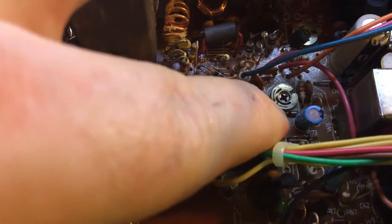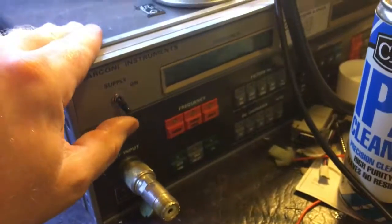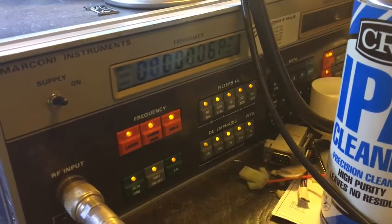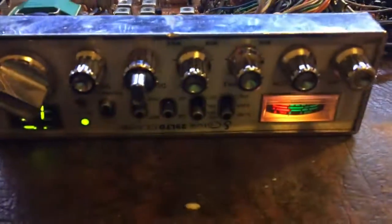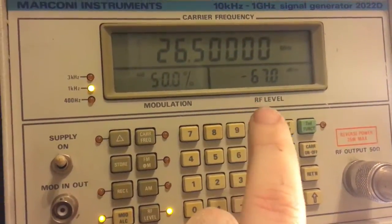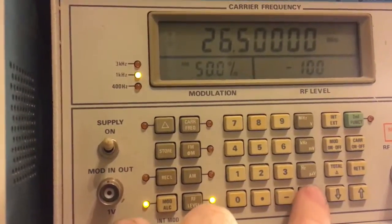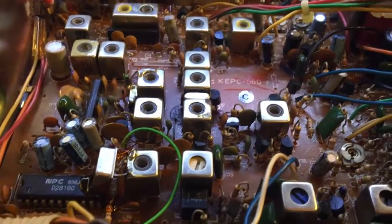The AMC pot is right there — I did actually have a bit of tape underneath it to stop it connecting, basically disabling the AMC, so I've re-enabled that and adjusted it. Unfortunately my Coney piece of test gear which I repaired not long ago has died again — it's got some kind of fault — so I can't actually do the modulation tests at the moment until I've repaired that. When I adjusted the receiver, I set it at minus 67 dBm which is for setting the S9 signal. I did need to set the level at about minus 100 dBm for a sensitive signal, otherwise the AGC can kick in and give you a false tuning.